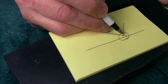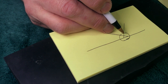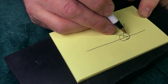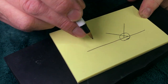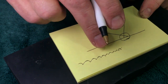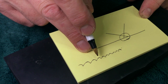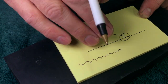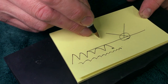This is almost like a perforation. At a microscopic level, at units of measure in the micron, submicron, and angstrom range, you are actually perforating it. That's why your edge is never really a perfect line. It's always kind of a little bit of a saw. It depends on how much magnification you're using, but you're always going to have that. By using finer and finer grits, you're healing. So you start off with big giant shark teeth, right?